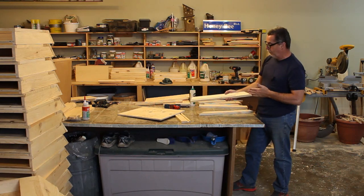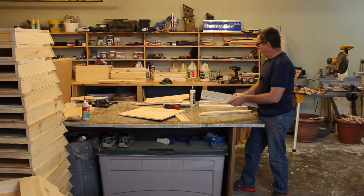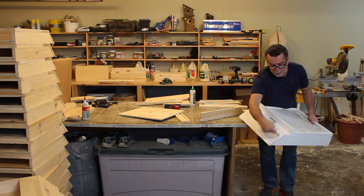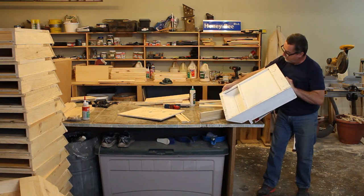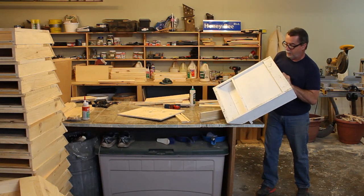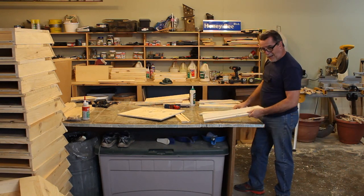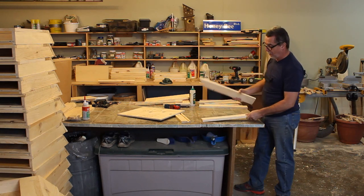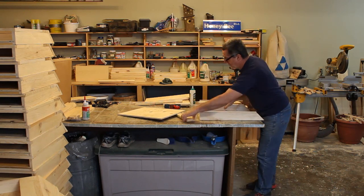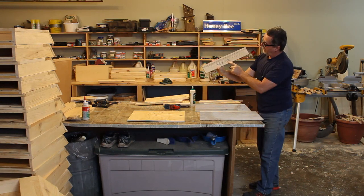On the bottom side I create a half-inch space and then a half-inch dado cut that I cut three-eighths of an inch deep. I used to run the dado all the way through which made it easier, but when putting the landing board on the screw kept landing in the groove. So on this batch I didn't run it all the way through — it's a little trickier to mill, and you end up with a left and a right. The back piece is three and one-eighth tall by eighteen and a half long.